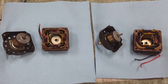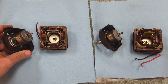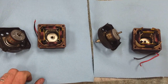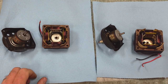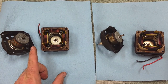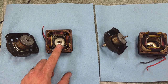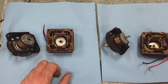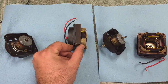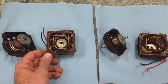So what's going on here? My theory is that the shaded pole magnets and the ceramic magnet on the back of the rotor lose their magnetism. If I increase the electromagnetic field by raising the voltage I can get this one to run at the right speed. However, then it gets incredibly hot from being over-voltage and will eventually burn up. People have also asked about making a phasing capacitor, but that would be difficult because the accessibility of the windings is limited, so it's not really practical.